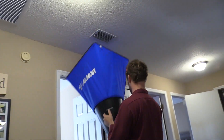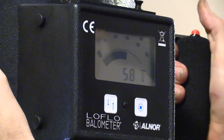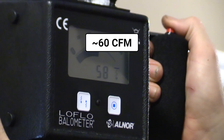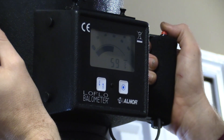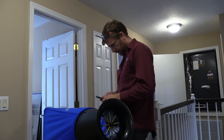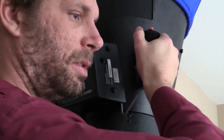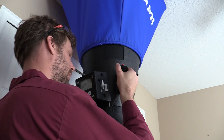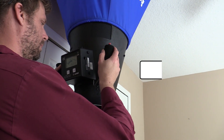I'm starting right here. This one's got 60, 58 — right about 60 CFM. You just have to let it sit long enough so that it's actually getting a consistent reading. And then what I'm doing is just marking that in each of the spaces. Now that main area — we didn't put a lot of airflow to it initially because it's a shared space and they were over-cooling it before, and it was affecting the thermostat which is out there in the hallway. All right, so this one's 152.